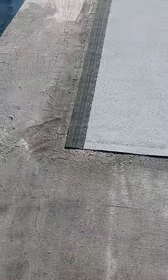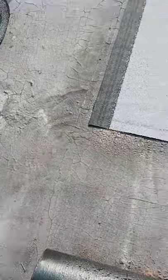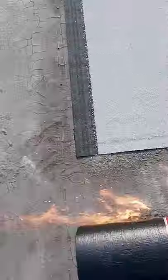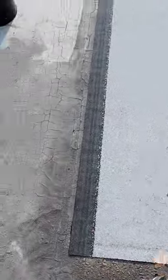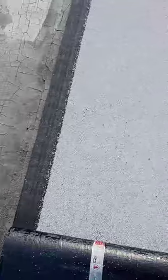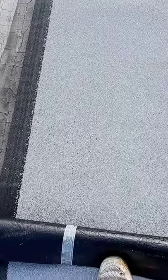I don't know if I can hold the camera while doing this, but we'll see if I can demonstrate how to seam it. Make sure you heat every bit of it. I'm almost there — burn the plastic off. Very hot, you've got to be very careful. Now I'm lapping it onto the next course. I heat the course as I'm lapping it so it sticks well. I heat the piece and walk it off.